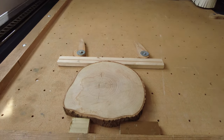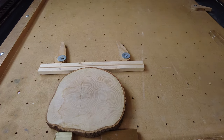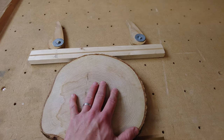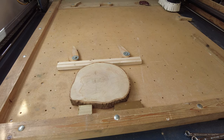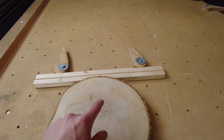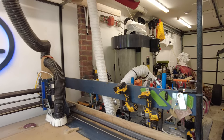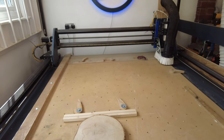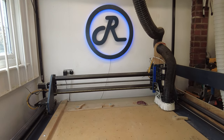Before we start machining we need to get this workpiece clamped down. I've used two pieces of wood and these little clamps from the Router CNC store — I find these handy because you can put them in the grid, twist them around, and it applies enough force to keep it rock solid. You'll notice I've got a little mark in the middle — this is going to be the zero-zero in X and Y that matches up on the Fusion 360 CAM model. When I bring the spindle over I'll set it on top and set that to be zero-zero. I'm going to use a touch-off probe to set the height from the workpiece, then it should just be press go. It will turn the dust extraction on to suck all the bits up and start the spindle to the correct speed. I'm running the Router controller — it's the older rev2 — but check the video description for the electronics details.